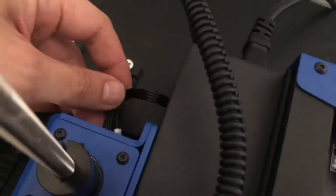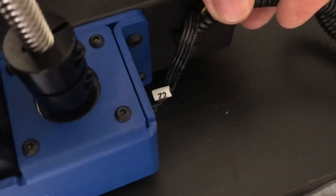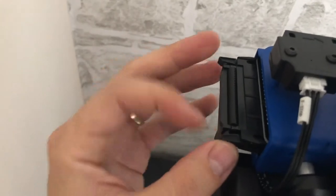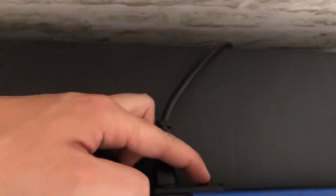The final bits of the single extruder assembly is just connecting the electrical parts — everything is labeled. You have Z1 for the Z motor and because you have two Z motors, Z2 at the other end. For the main one you have a big ribbon connector. Everything goes through these connectors, so just this one plug connects everything else, which is really convenient. It only takes a few minutes to get the whole printer assembled and ready to print.